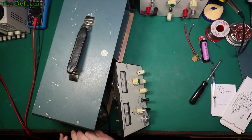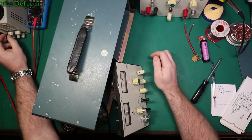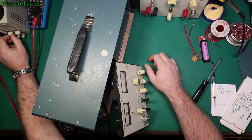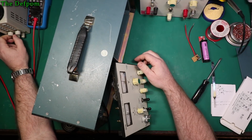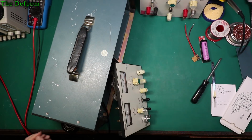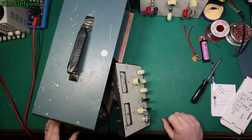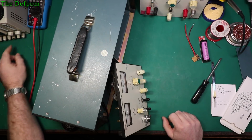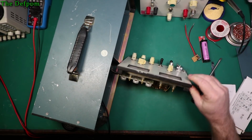If I do 1.5k instead, right, so that's 1.5k, so sitting right at the bottom end of that really, at 4.2 volts. And if I drop it down, say 3.5, you know, so go 3 volts there, so it's slightly lower, not a huge amount. So I'm going to base it on the high level 4.2 volt battery when it's fully charged, and the 1k resistor. Right, so 1k is up there, which is like the most it should be. So that's what I'm going to base it on. So if I stick a 1k resistor in series of those wires, that should give me the correct reading for checking the battery voltage to make sure it's charged up okay.